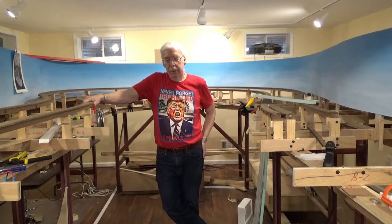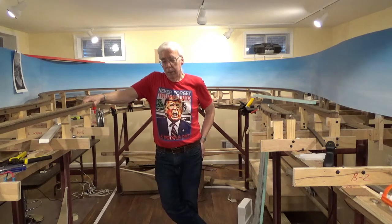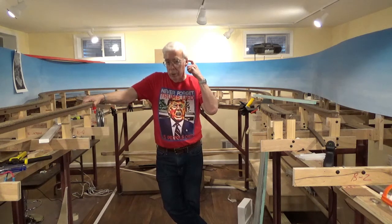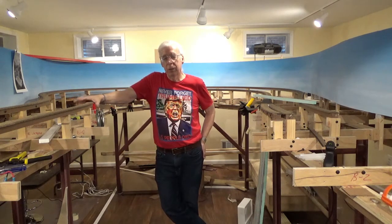It's kind of a messy job, but I figured out a way to make it less messy. I wouldn't say not messy, but a lot less messy. And I did it by fitting one of the nozzles to my Ryobi battery-powered handheld vac to the back of my Craftsman 4-inch electric handheld belt sander. And that did a pretty good job. That was picking up the dust as it was flying out the back of the sander, and the sander has a catch bag, but it really doesn't do all that great. But between the two of them, I probably caught about 80% of the dust coming off of it.